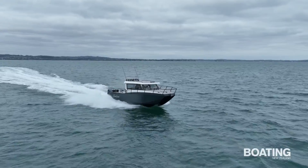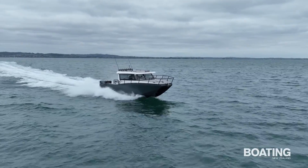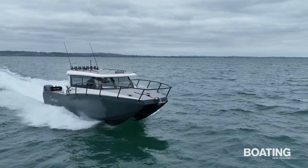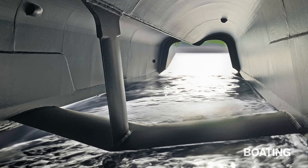The dihedral foil is another important component. Jeremy Behrens, General Manager of LaserCraft, says that the design is based on more than 20 years of experience working on hydrofoil supported catamarans. The LaserCraft foil was developed by Jeremy in collaboration with Icarus Marine Naval Architects. The dihedral shape of the foil not only provides lift to reduce the wetted surface and hence lower the drag, but also continues to provide that lift even when the boat turns sharply.